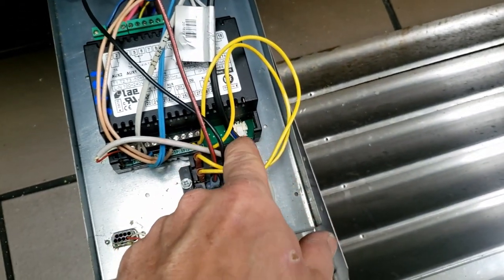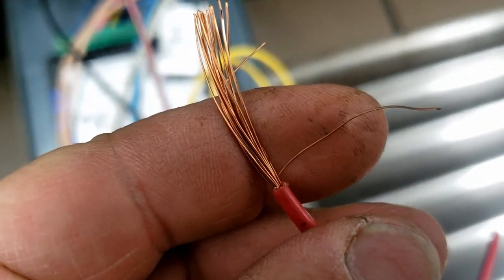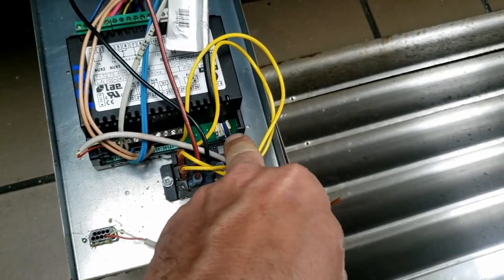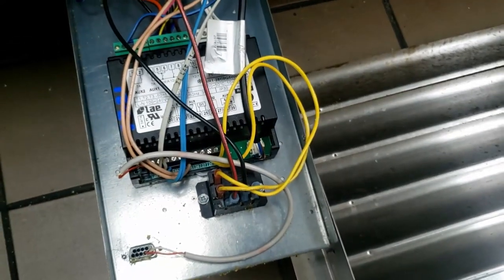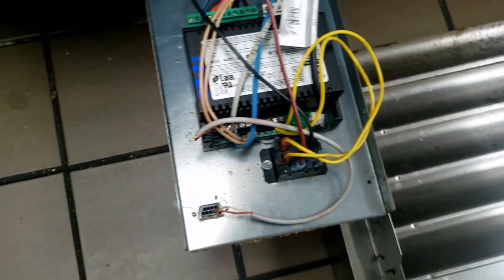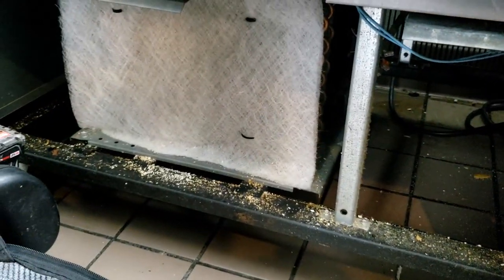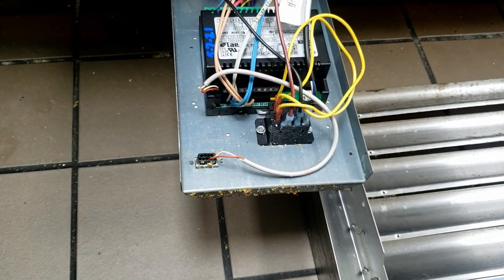What you want to do is unplug the connector and check continuity between the three or four wires. I put a little wire thread into the connector on the outside, then came down with back probes made for small connectors and back-probed it to confirm continuity. Then went from number two to number three — just like checking three-phase voltage — and checked resistance through the cable. Everything checked out fine, but plugging and unplugging it nothing worked, so they had to send a whole new kit. This thing has two compressors, and they're using an isolation relay to help divide the load.